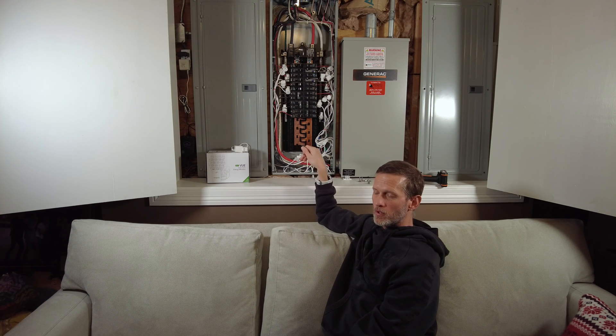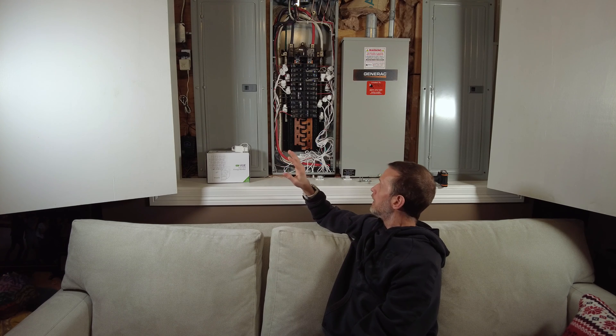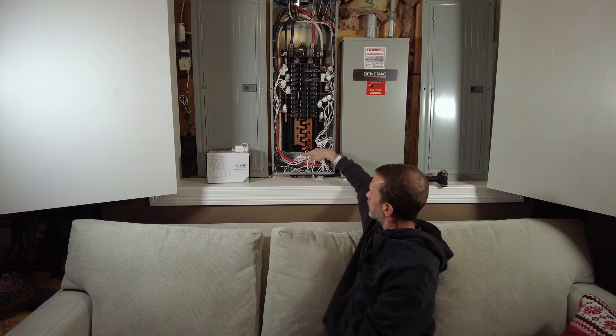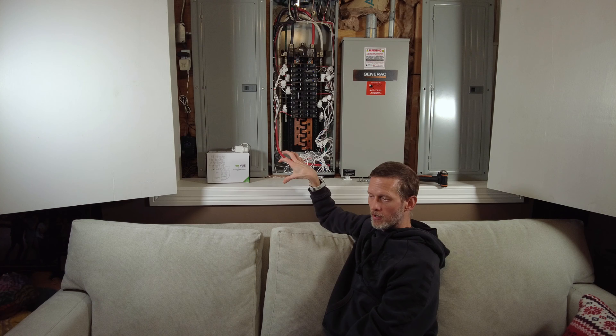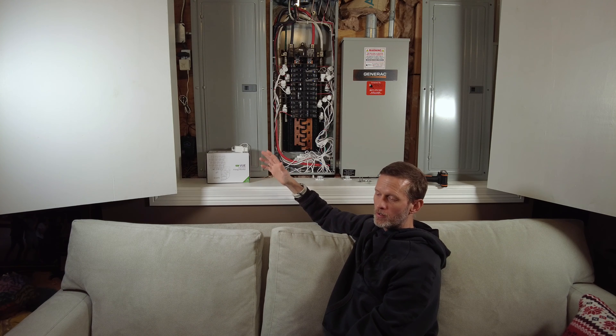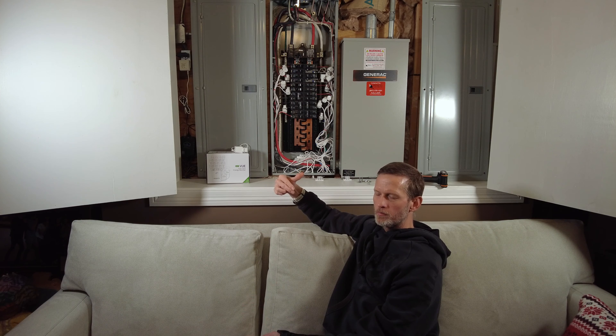A couple of other installation notes with the View: the numbers on the back are not in the order I would expect, so when I originally set up my circuit map I messed that up — just something to be aware of. Also, the CT connectors don't have a lot of positive feedback when you plug them in, and they can come out when you're wrestling the unit into the panel. I had that happen with a couple of them. I engaged support, and they were not helpful at all. I eventually figured it out, and when I mentioned it to them they said it can happen and suggested wrapping them in electrical tape or replacing the unit. I just installed them all the way and crossed my fingers, and it's been fine.